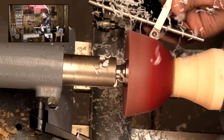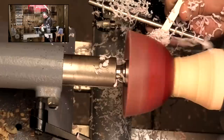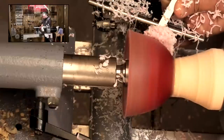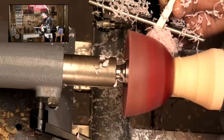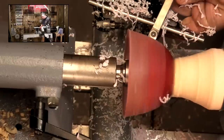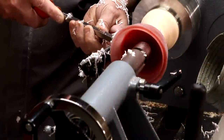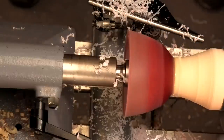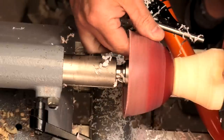The negative rake scraping tip gives a softer attack to the resin. I'm taking it easy, not going too fast — I don't want to heat the resin up. That's about as far as I can get around with the tool. Let's come back up and make sure I've covered everything. That's looking good already. What I don't want is any exploding — without a negative rake, it can be a little bit aggressive; scrapers on resin can cause it to explode away.